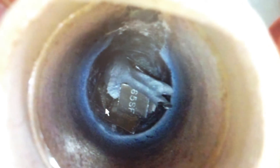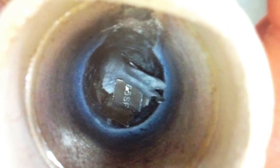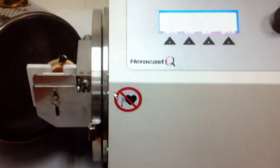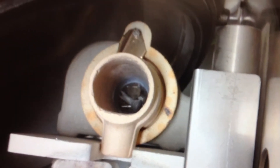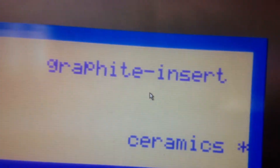These are the metals I'll be casting with. This is a 65% gold and 26% palladium with a few other metals in there. This is one of the bio-alloys that I use, because basically these castings are going into somebody's — they're bolted to somebody's body, actually. So they have to be very good quality materials for them to be bio-compatible.